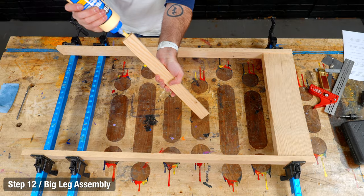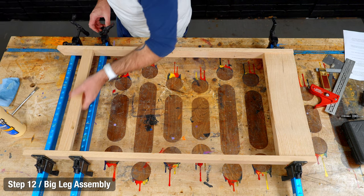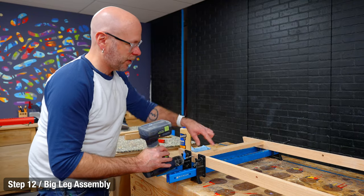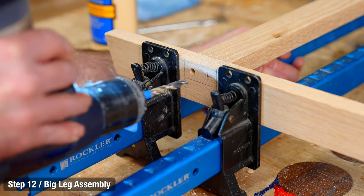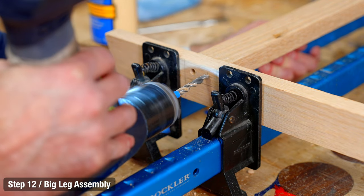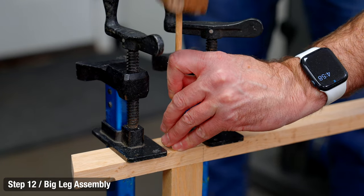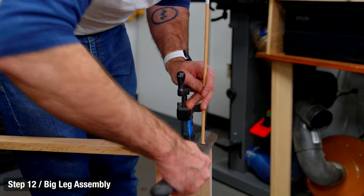This piece is a little trickier because it's flush with the top and not the back — though not that tricky. I need to make sure I'm drilling fairly straight so I don't blow out the top or the bottom. Then I can fill that with some glue and pound in some dowels.